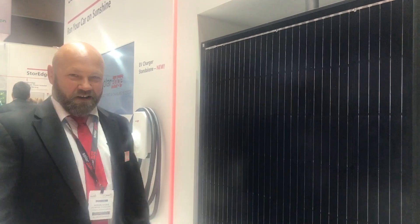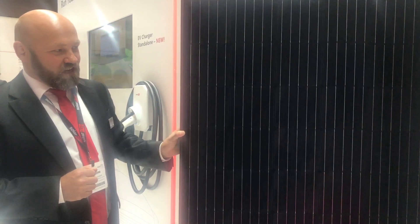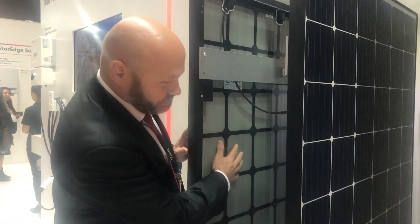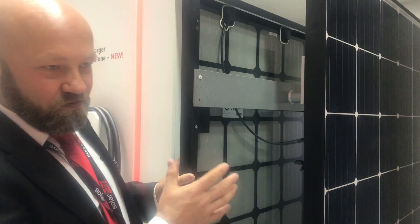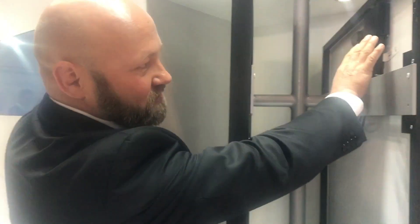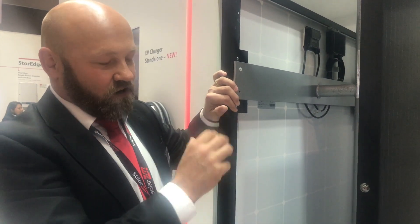So what are we looking at here? It's a solar panel — but why is it on the SolarEdge stand? Well, it looks nice — it's got a nice black frame and backing sheet. These are 300 watt solar modules. This particular module is glass on glass — you can see the glass back. It's longer-lasting than plastic back systems, though we do have the plastic back version as well. There's a price difference. These are a SolarEdge product — they have an integrated optimiser on the unit. On the standard panel the optimiser is on the top of the frame, and on the glass back version it's on the side. This product can only be bought through SolarEdge — it's specifically packaged and designed for our product.